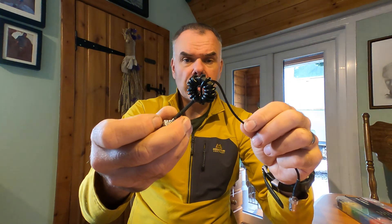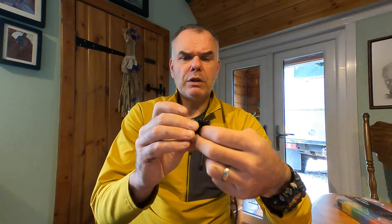I use this with a choke — I pre-made this choke ages ago with two BNCs. It's a ferrite core, I think it's probably a dozen turns around it. It's the most simple choke to wind. Why would I use a choke? Well, it's not a balanced antenna, and even with QRP there's going to be some RF heading back towards your radio, and the choke blocks it from the outer shield of the coax.